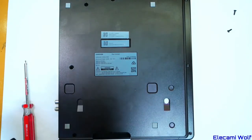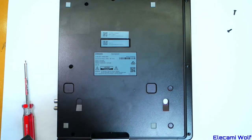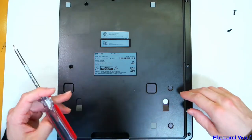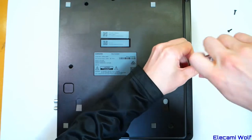Let's work out how much current would flow through the One Connect cable: 420 watts divided by 55 volts equals 7.6 amps that need to flow through the cable to power the TV. That's a pretty hungry TV — I suppose that's what you get when you have those huge ones, 80 inches or whatever.